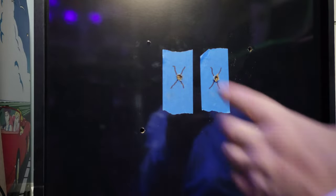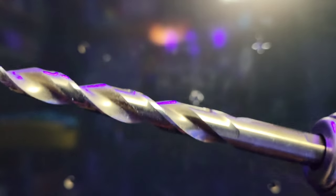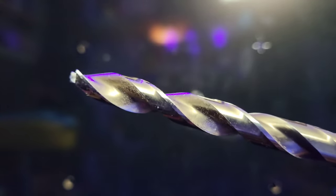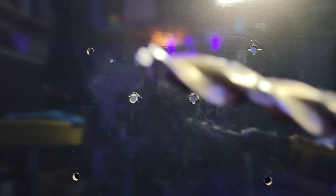I did move up from the 5/16ths drill bit and went up a size to 3/8ths. The 5/16ths was just a little too snug — I didn't want that much pressure on the red areas of the LEDs. The 3/8ths is the better size to go with. If the holes are a little too loose with the 3/8ths, you can always wrap a little black electrical tape around the red area to make it more snug.